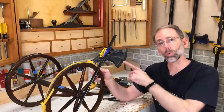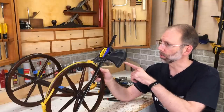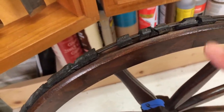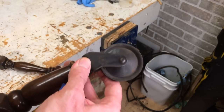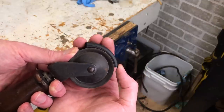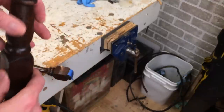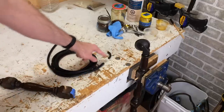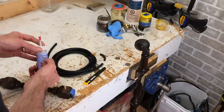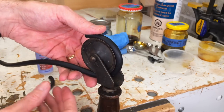If you're enjoying this video, please give it a thumbs up — that helps other people find our videos. Now for the other wheel, the tire is really deteriorated — you can see this rubber is so bad there are actually pieces missing from it. We'll get this fixed up looking as good as new. Next I'm going to work on the small tires. These caster wheels are just two pieces of metal together with an old piece of rubber that's rock hard, so I'm going to put new rubber on them. The replacement rubber is 3/8 inch, the same diameter, and I need to cut it and glue it with CA glue.